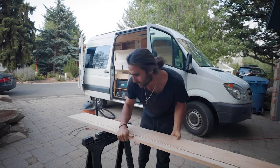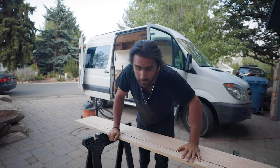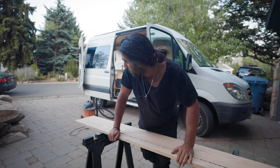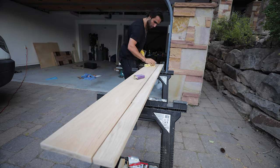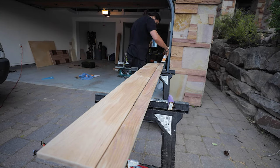The final thing I'm going to do for the night is polyurethane this big step piece that runs on the passenger side. I've been putting this off for a while so I figured today is a good time to do it. Three coats of polyurethane, three different grits of sanding. I'll get at least one coat on tonight, but first I'm going to take 150 grit sandpaper and sand this thing down. I have one coat on now — I'll let this sit overnight before another round of sanding and another coat of polyurethane. Signing off for the night.